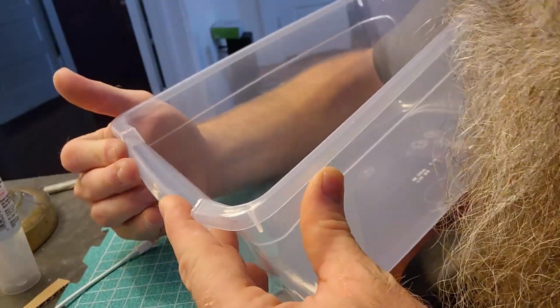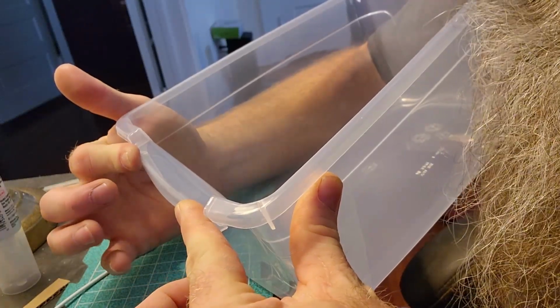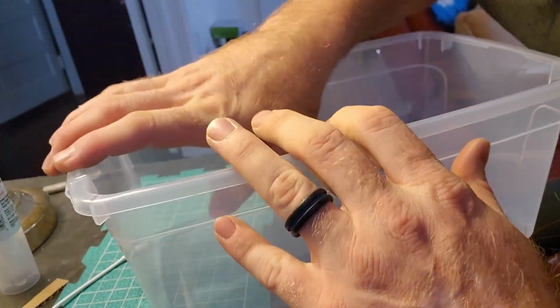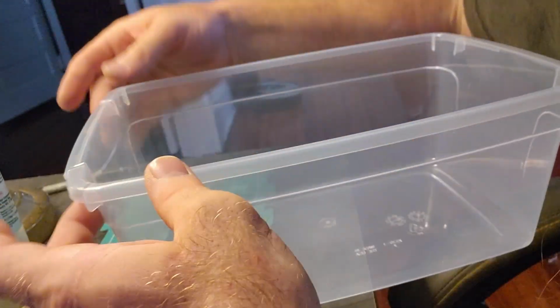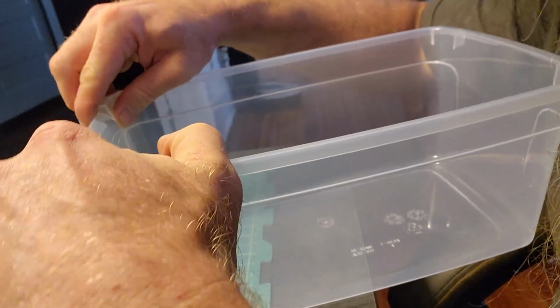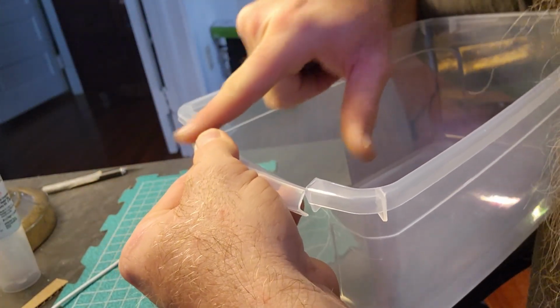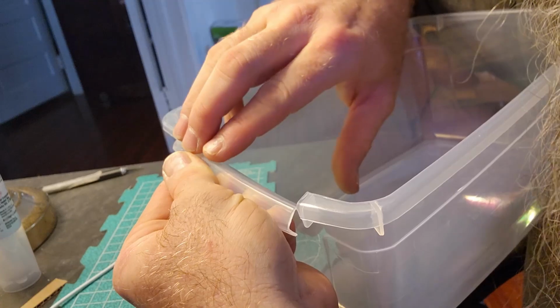All you need is 1/4 of an inch at the top. That's about how the water is going to flow. Maybe down to about right there, about 3/8 of an inch. On both sides, I'll heat this up, fold it over, and then throw some of this in those two gaps. Do it on the inside, in here, and then we'll also put some right here along that crack, so we make sure that the water stays on top of this. That'll give us a nice little sheet going down into the next set.